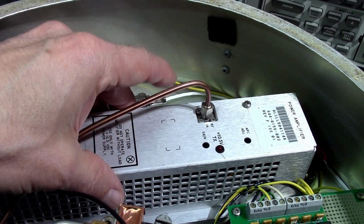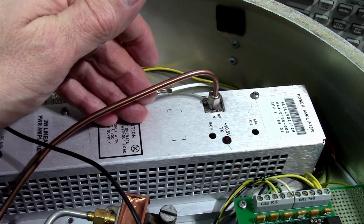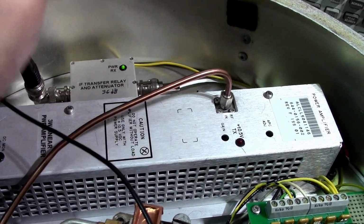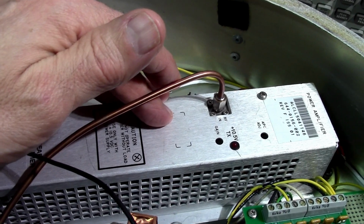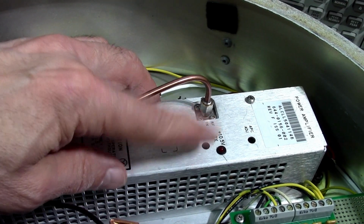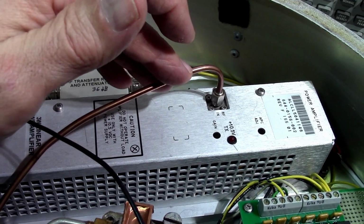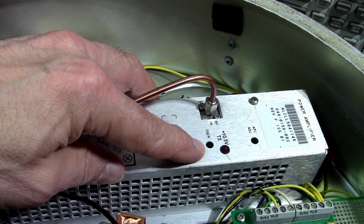It happens that this brick also receives minus 12 volts from the Alcatel power supply that came with it. I decided not to supply that minus 12 volts because it's another negative voltage that's harder to produce. So I've decided to not use it. And it was also with the advice of the person who gave it to me. He said, I'm not even sure, I think it's for the protection, automatic protection system, that the -12 is used. Well, it's more than that. The -12 is also used to make this gain adjust work. So it clearly changes the bias on the amplifiers, maybe one of the stages, input stage maybe. So without the -12 fed to the amplifier, the brick is full on. There's no gain adjust, it's full gain out.